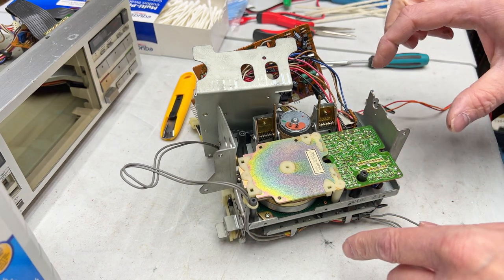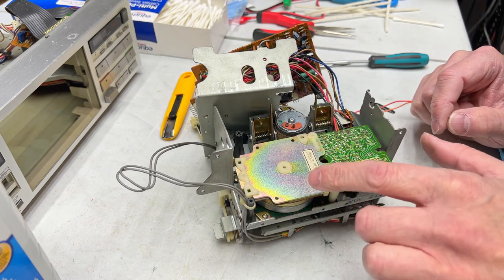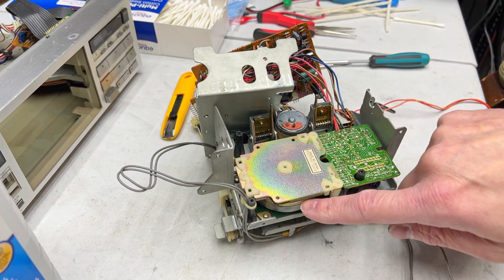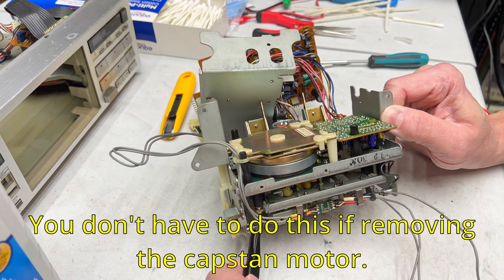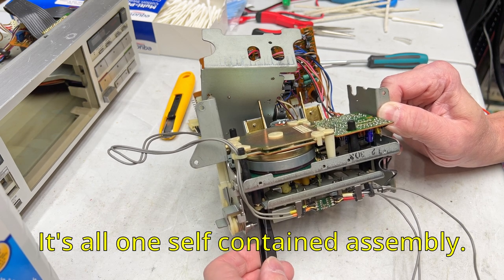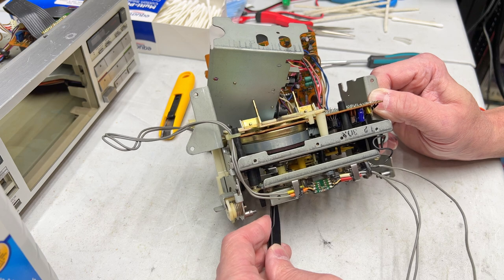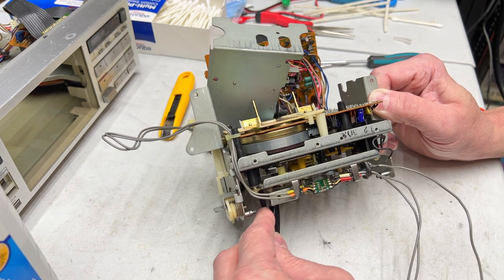And we should be able to just pull the motor board off now, and the coils and all that other good stuff. Oh, I see, everything has to come off. Thanks, JVC. And this means I'm going to be losing my oil control washer on the front side of the capstan. I forgot to take that off. Again, I'm not real worried about damaging anything. $105 tape deck. If I break something, I can just get another one. And I almost did get another one, fairly recently, before I found that next quote-unquote dragon killer.